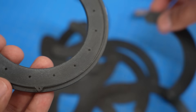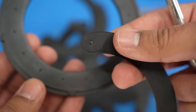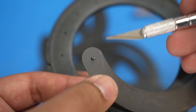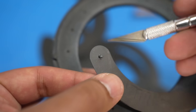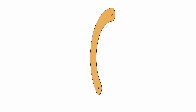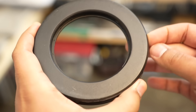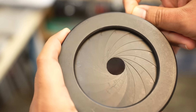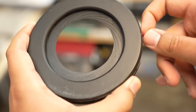This type of iris requires the blades to have opposing pins on either end. The blade is too delicate to be printed with support material, so I split each blade into two pieces — one main blade with an integrated pin and an absolutely tiny separate pin meant to be superglued into the matching hole. Does it work? I'm happy with it, actually. If you have any ideas how to make this kind of blade assembly easier, I would love to know, so please leave a comment.